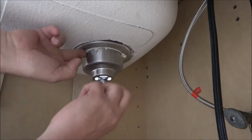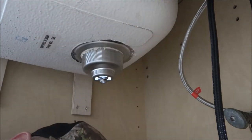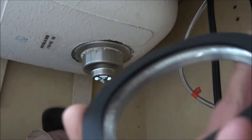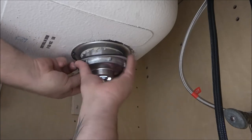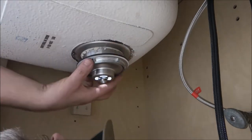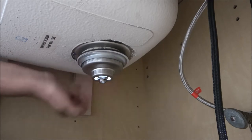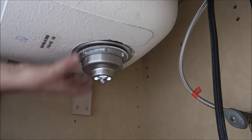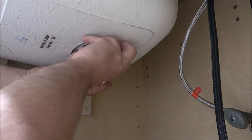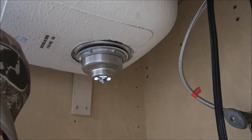As you can see we've got some putty that squeezed out through there — just take that off with your finger all the way around. Now we're going to put our rubber washer on first, then our little cardboard piece — they call it a friction ring. Start the locknut up on here. If it doesn't go, turn it backwards a couple times then go forward and it'll thread on. With clean threads you should be able to finger-tighten it. Try to keep it as centered as possible.